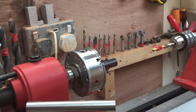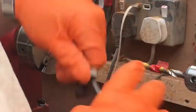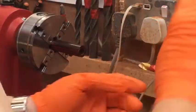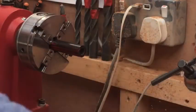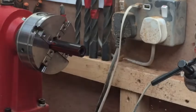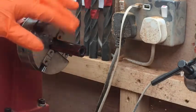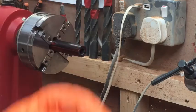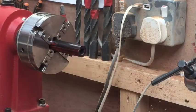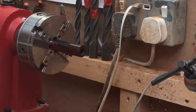It's a perfect fit, so we're going to glue that in. Before we glue the tenon in, I'm going to drill the draft hole. What I've done is marked off this drill bit, which will give me about half an inch — a little bit more — at the other end of the stem, to drill it with a thinner diameter drill bit so I can chamfer it down as thin as I want at the biting zone.